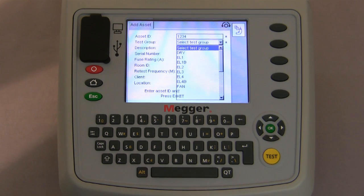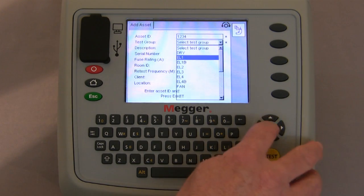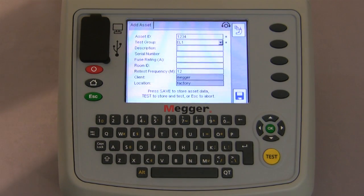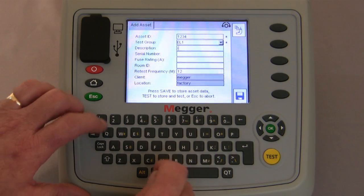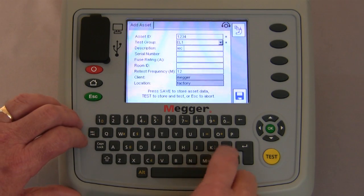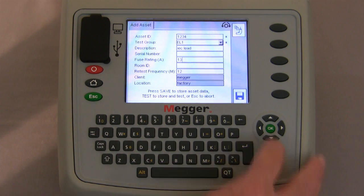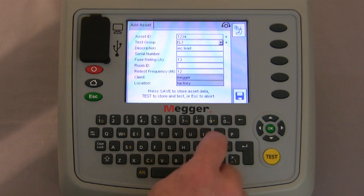In this instance, we're going to test an extension lead, a class 1 extension lead. So we'll scroll down to EL1 and press the select key. Using the navigation keys again, we move down and type in the description. Then the serial number, if there is one that's applicable to that piece of equipment, the fuse rating of the piece of equipment, and the room that the piece of equipment is in.